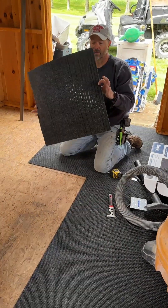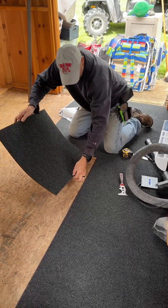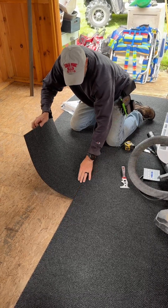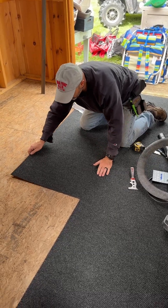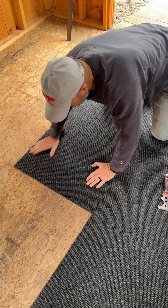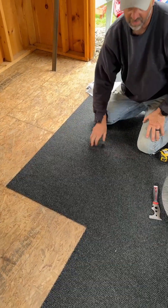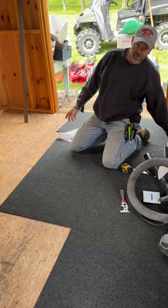Here we are. We've got our tile oriented, going towards the door with our arrows. I usually start in the middle — tuck it in there, get it nice and flat. Follow your edge, bring the next one together, make any minor adjustments to keep it square. Hold a little bit of tension on your tile to keep it square with the others. Work your way down and out, pulling back towards where you are working. You get a nice blended seam that disappears amongst the other tiles.